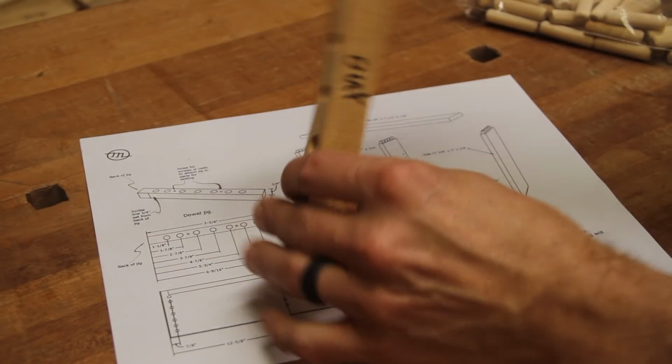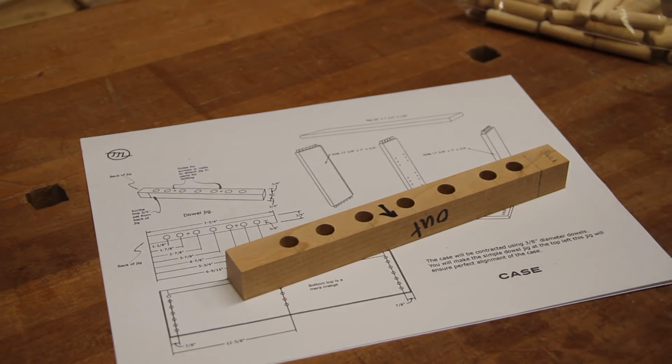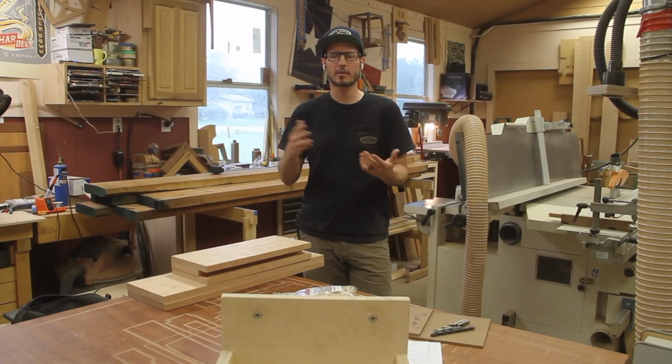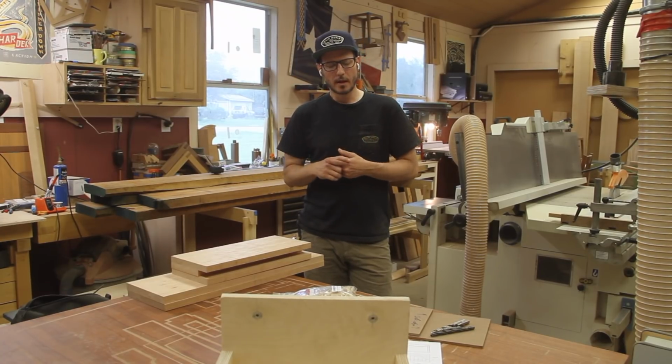I'm a big believer of using reference faces and basically setup, right? So if you're a 30-second off on a side, you don't go change your setup block and cut the next side perfect to your number. You cut them both the same. At the end of the day, that's what matters, that things are consistent.